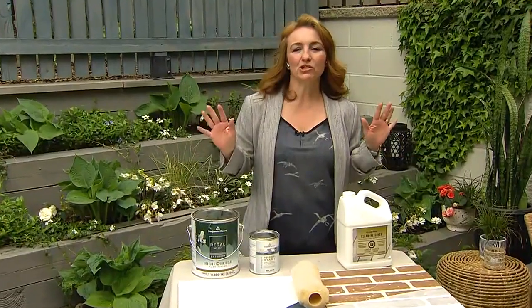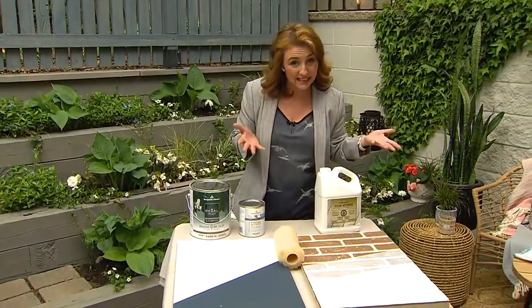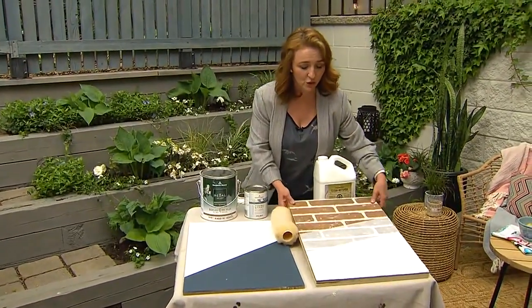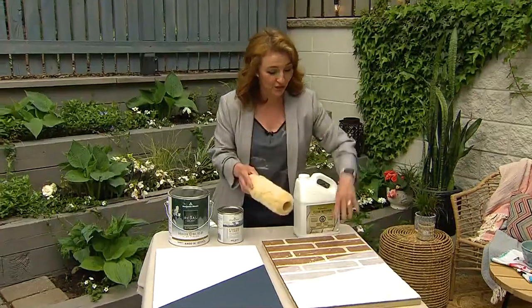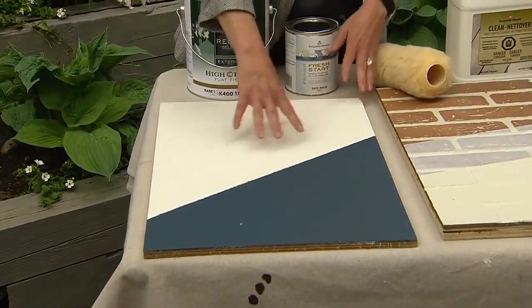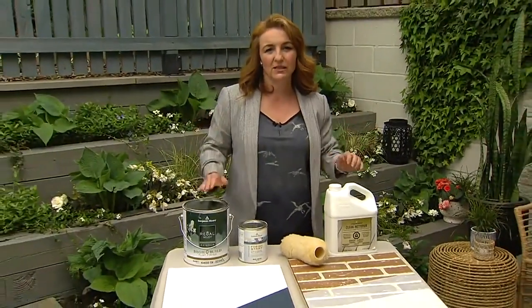What if you want to paint brick or stucco outside — is it pretty much the same process? It is pretty much, Tracy, because they're masonry products. You definitely need to do the same process — make sure it's super dry, that's really important, and of course clean. With brick, you don't need a heavy-duty thick block primer like I used for the concrete wall; you can get away with just using a regular Fresh Start all-purpose primer. It usually helps to seal the brick before you put the paint on, and you can use the same thick pile roller sleeve because there are grooves in brick. Then you can use Aura or Regal Exterior. Stucco is pretty much the exact same thing — make sure it's clean, do any repairs in advance, then go directly on with two coats of flat or maybe a low luster. I probably wouldn't go too much shinier than that on masonry products — you want to keep them feeling natural.